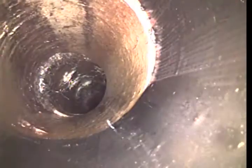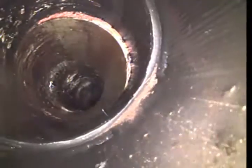Yeah, we're probably going to recable this with a larger tip. Get a little more out of here if we can. A lot of times, since we've already got it open, sometimes additional cabling, we just move the roots around but don't actually get them out. Right here at 70 feet, 69.5 feet roughly, is where they did a pipe burst. Another contractor tied onto this and came back to the house, or to this outside clean out, with more modern plastic pipe material.